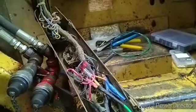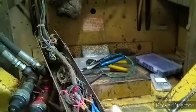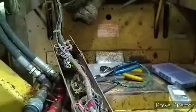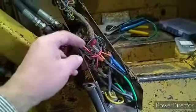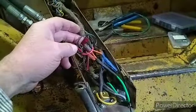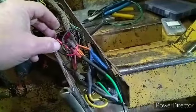The only thing I can think of is if it has something to do with the idiot lights. Because I've got one important one right there that always comes on when you go to start it. It's my hydraulic pressure indicator. And I can't seem to get it to come on. But if I flick the switch and I bump the button, I've got power to the starter. So everything else is working. And I kind of thought it might have had something to do with this, because this is wired in kind of there.